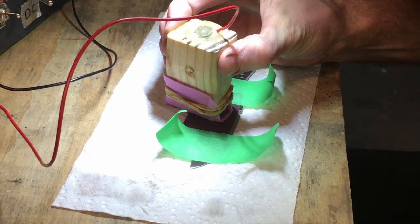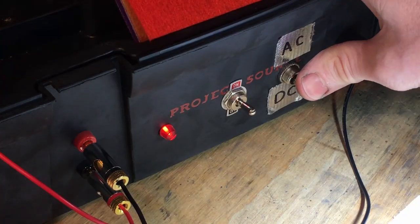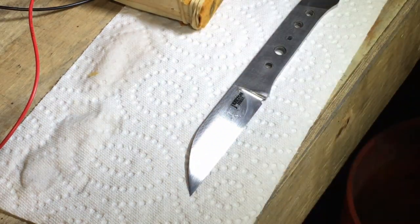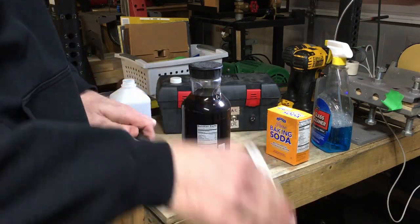Make sure that you've etched on your touch mark as well. If I'm stone washing a blade, I'll etch my touch mark exclusively on DC power, since I'm trying to get a deep etch and not necessarily a dark etch, which you'll get with AC power etching. After your blade is etched and sanded, go ahead and wipe it down with alcohol to make sure it's nice and clean.